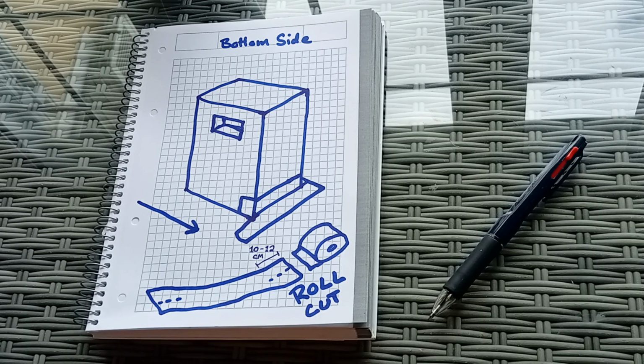We're going to cut 4 strips of flashing, 1 for each side of the chimney, and work from the bottom up. This is the same process for metal, asphalt shingle, or this roll flashing. You want the rainwater to flow over the seams and not against or into them. Everything will overlap from the top down.